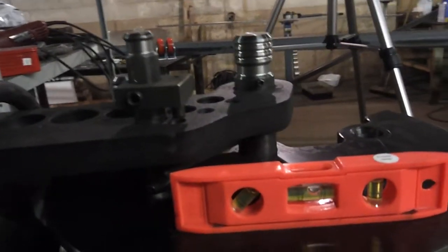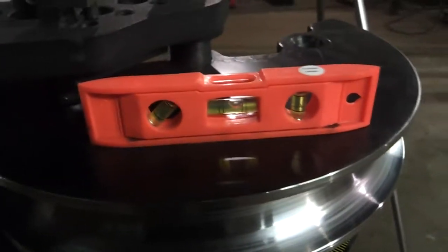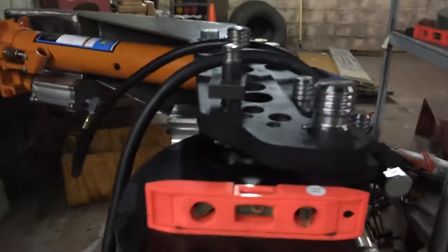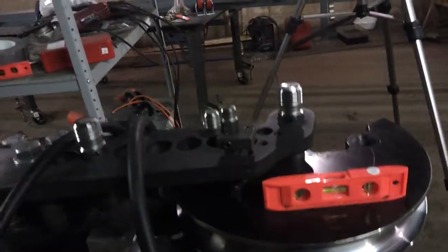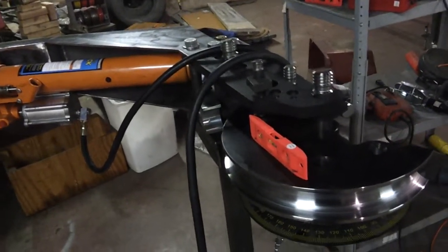It's kind of okay that it wobbles because I want this to sit as level as possible — my floor is not level. So what I plan on doing is putting my levels on here. It's slightly off level. Because this moves, I'm able to do a brace and lean it in the direction it needs to go to level it out right before I bolt those braces to the ground. The reason you do that is because this die set, if it's completely leveled across both ways, when you load in your tubing and your tubing is level, you know that it's straight.